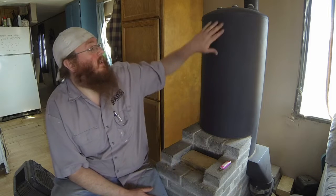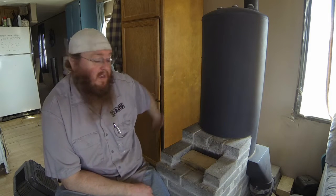This is the finished rocket stove — or rocket heater, or whatever you want to call it. There's no mass so it's not a rocket mass heater yet. It is spring after I made this, so this thing has gone through one winter with us. I never got the shielding up because the pieces I was going to use have been frozen to the ground and covered in snow for months. We've been running it most of the winter on cut-up pallets, going through about a pallet a day to heat this place — and that's without the mass.